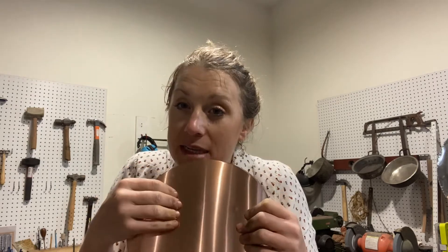Just using a regular soldering iron can do one of two things: it can take forever because the copper will only get hot enough right where your soldering iron is, but it won't spread the tin — you won't get that nice smooth texture, you're going to have really frosty tin. Also, you might end up cold soldering, meaning it'll look like the tin has taken but it really hasn't bonded molecularly, and it will just pop or chip off — even as you're cleaning, riveting, or when a customer uses it for the first time.